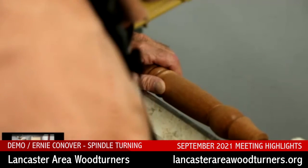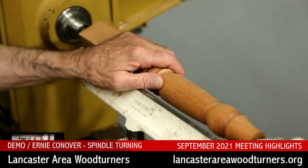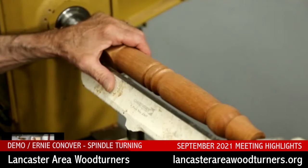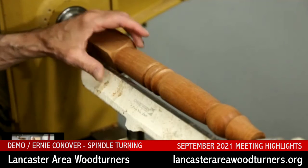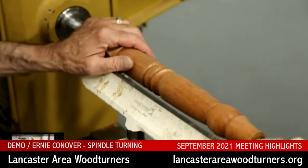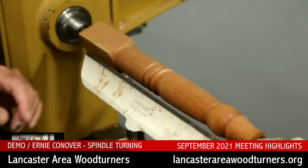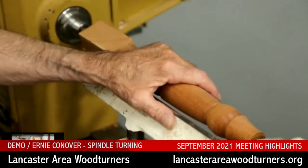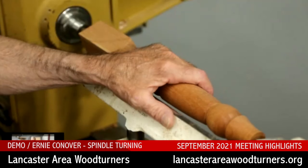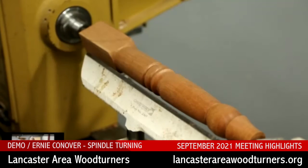So another scheme that I feel very strongly about: you're better to turn like 2-3 times a week when you're learning, for an hour to 2 hours at the most, and then just do it over and have some little project, make a candlestick or a table leg. A Windsor chair leg is a great turning exercise. Just stack them up one by one and you'll see your skills improve. Now, another wood, like poplar, is very abundant around here. It's a great practice wood.